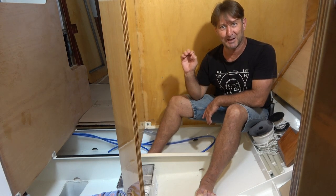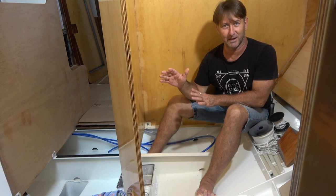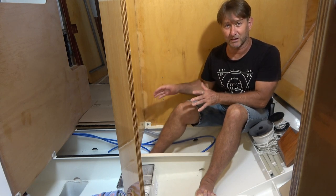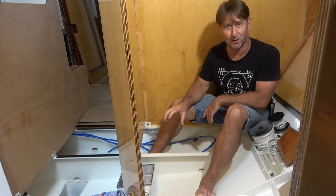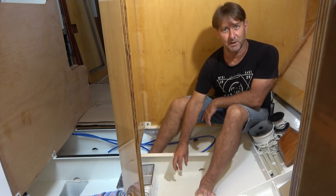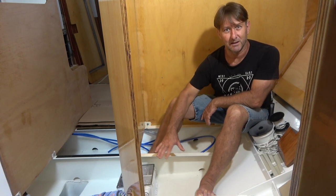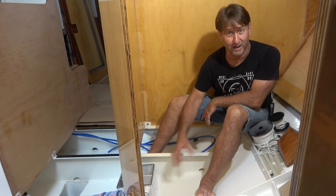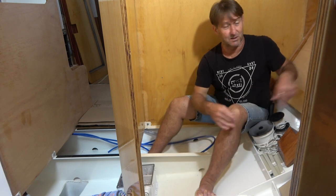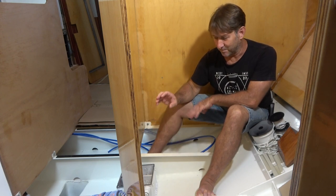That's actually been a blessing in disguise because a number of things have completely changed what my plan's going to be now. Instead of having it in this bay, right below where I was going to site the drain, which would have been pretty much between your feet, now, because of how I need to mount this box, I'm going to shift it to this next bay over. And what that'll mean is the drain can also be here. Just two elbows will direct it to the sump box, but there'll be no need to drill holes in any of the floors in order to collect the water and also to discharge it. And also the power for that can be run in the same section and disappear under the cabinetry here. So as I say, that has been a blessing in disguise, making things much simpler.